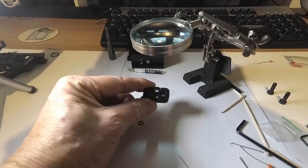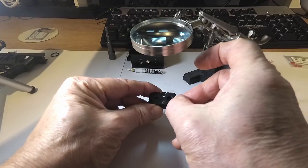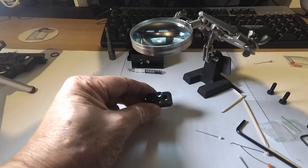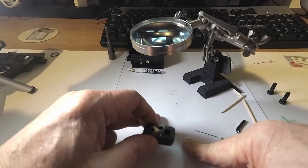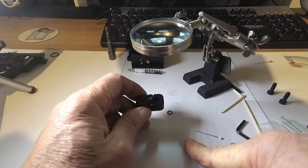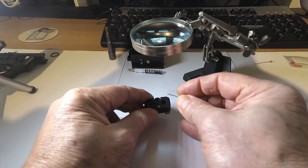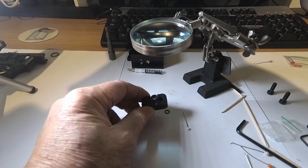Well, I've had a very frustrating time trying to get the breech seal out. It's a little O-ring that sits down just there, which is what the probe comes in against and seals against. If that is leaking, of course, even slightly, you'll get inconsistent shots with varying muzzle velocity. So I was determined to get it out, and I followed advice seen on the Weihrauch Owners Club website, which recommended pushing a pin into the O-ring itself. Of course, I was conscious of being as careful as possible, because I wouldn't want to introduce any scratches there that could affect the seal.